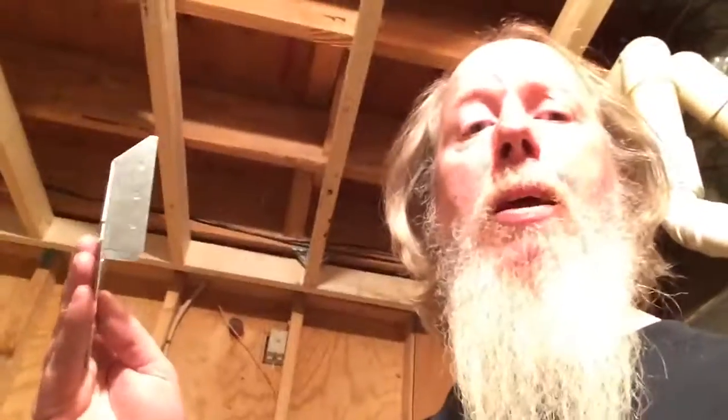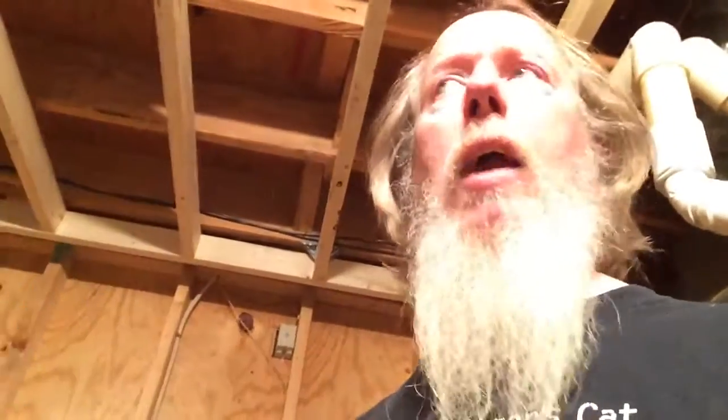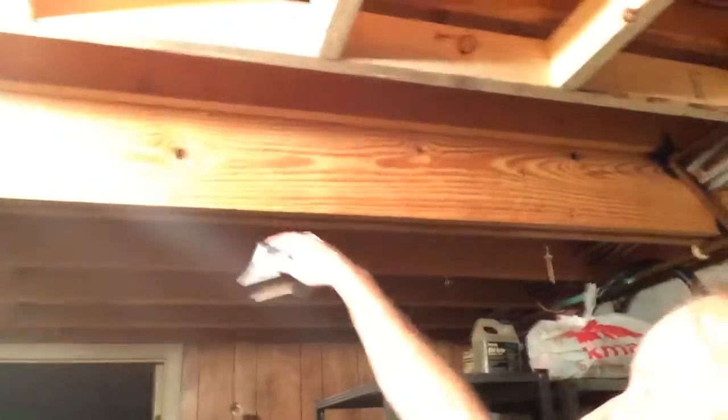So I've got to get to work. I'm going to be mounting quite a few more of these hurricane ties to give stability to the ceiling. It's suspended and just hanging from the rafters, which are the floor joists. I've got four right now and figure I need about a dozen more to cover the eight-by-eight square I've got. And the back end here — you can see there's a step down by about eight inches because of the open floor plan above. This is the beginning of the living room going into the next room, so the ceiling is going to angle down and then come across, about one extra stud — another 16 to 18 inches.